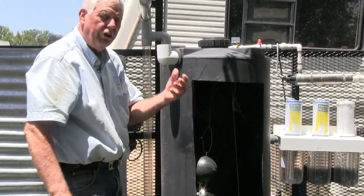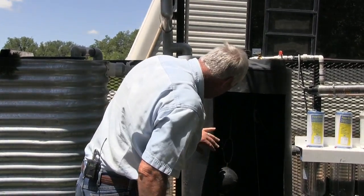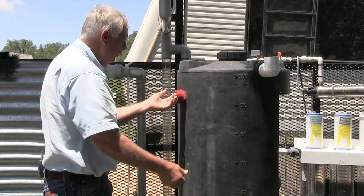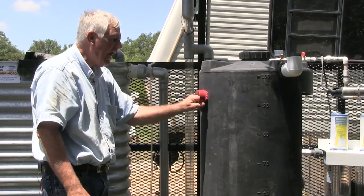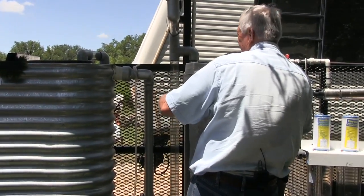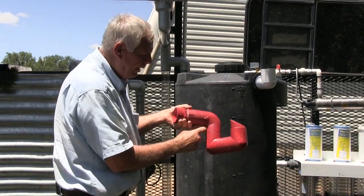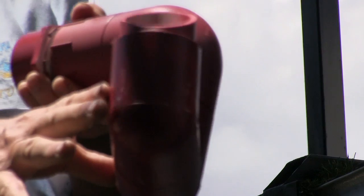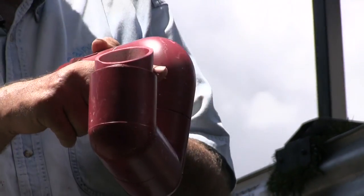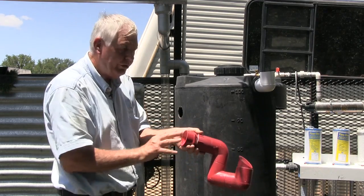It's a mechanical device, though there are electrical ones I could use as well. Inside the tank there is also an overflow, tied in on the inside as what's called a skimming overflow. It has a small p-trap with a little bit of water so critters cannot enter, and it's cut at an angle so it takes water from the top and directs it to the overflow.